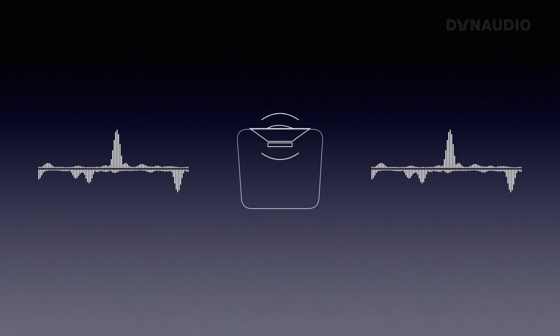An open baffle is one that is so large that the sound from the back does not reach the front. The problem with that is it takes up a lot of space in your listening room, so most people don't really want to do that. Typically, we wrap this baffle around to create a cabinet. You have now created a box of air that the driver needs to push against when it's playing music, and the volume of that space has a big effect on the actual sound of the driver. This becomes the whole conundrum of designing a speaker cabinet that works optimally with a particular driver.